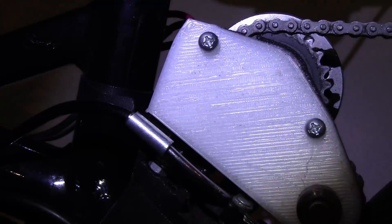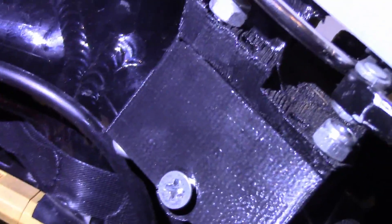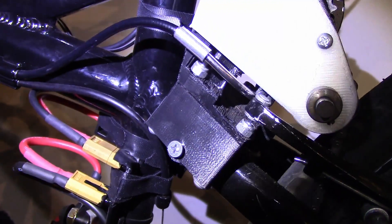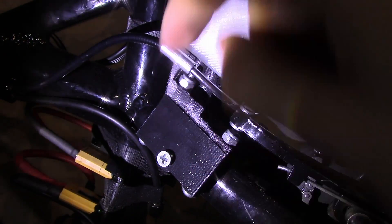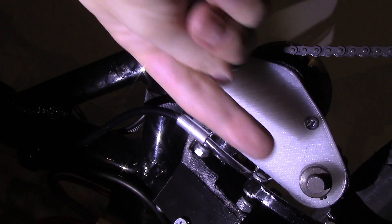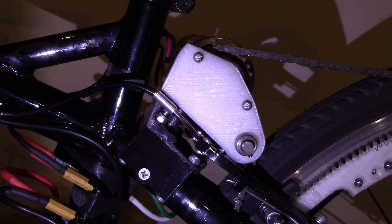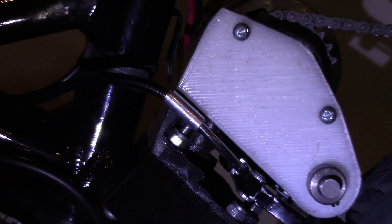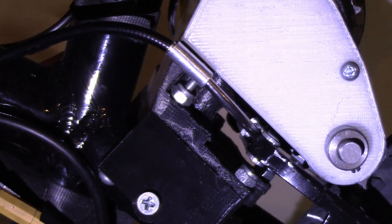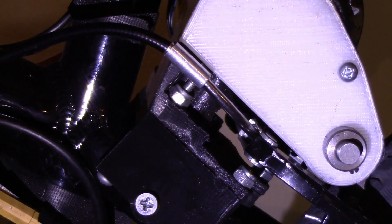Failure? You know, it's what we do. The motor mount is made in two sections joined in the middle. The bottom section bolts into some holes in the bike, and the top section bolts into that. That's not a solid piece for ease of 3D printing — the bottom section had this edge as its ground plane sitting on the glass, and that's how I can make this huge overhang to kind of miss the rear brake. When I was initially laying out this design, I assumed I would have to remove the rear brake to give enough space to mount the motor. But to my chagrin, I actually was able to do this without removing it — which resulted in absolutely no tolerance, no clearance, and no way to easily work on this bike. But I didn't have to remove the rear brake, so I guess only I lose.